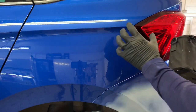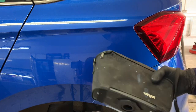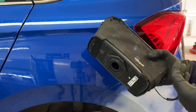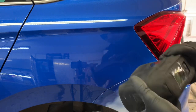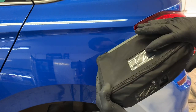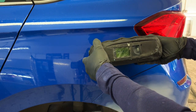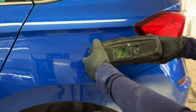Always make sure you clean the panel that you're going to be taking the reading from — you don't want to be taking a reading off a dirty panel. This cover that comes with the spectrophotometer has a little strap on it. I always put it on my hand because it's an expensive piece of machinery — I just don't want to drop it. So we've now got the choice of take a reading. You can click either that button or the little dial on the top. It says take one of three readings, so all you have to do is put it on there and all three feet have to touch. That has worked — you can hear it's clicked.